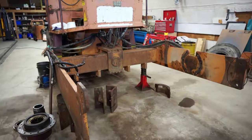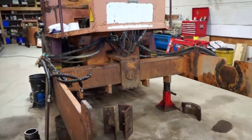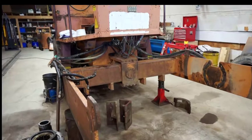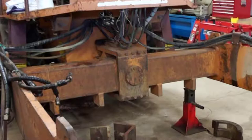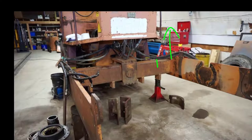This style of roller packer has two frames held together by a hitch. The front frame holds the drum and the rear frame holds the operator station, engine, pumps, etc. Vertical pins and hydraulic cylinders allow the machine to steer in an articulated fashion. Horizontal pins allow the machine to oscillate over uneven ground.